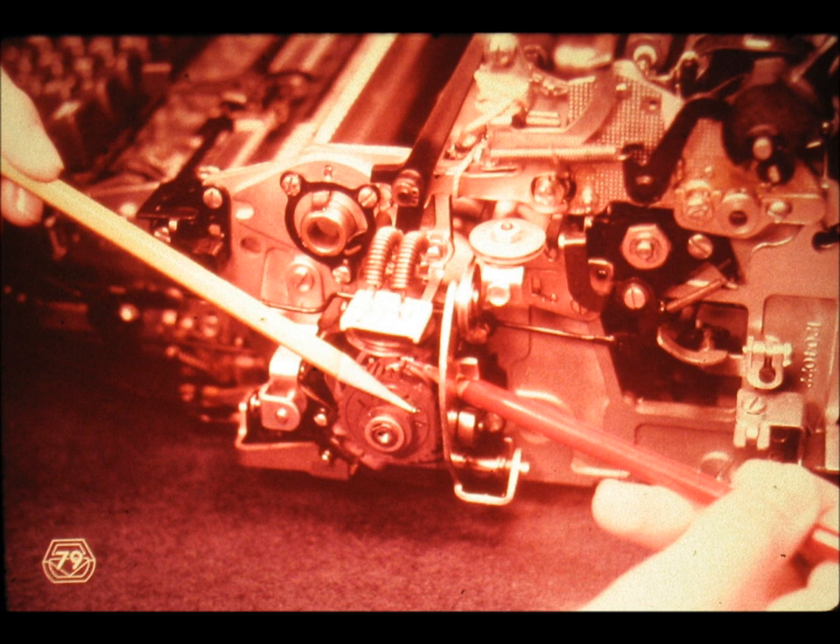It takes a bit of analyzing what happens when the rotation of the shift cam is interrupted. Let us go through it once, assuming that the operational shaft is being turned by the power of the motor. Since the shift ratchet in reality is only a sleeve which fits over the right end of the shift clutch spring, when we stop the shift ratchet, we also stop the right end of the shift clutch spring. The shift cam, however, has acquired inertia under the action of the motor and it continues to turn. The result is that the clutch spring expands and disengages the clutch, breaking the connection between the operational shaft and the cam. In order to hold the clutch spring in its expanded form, the shift clutch uses the shift cam brake for its small character position and a detent for the capital character position.